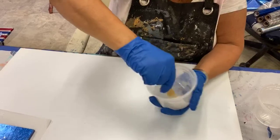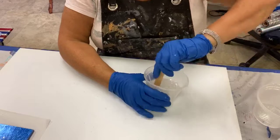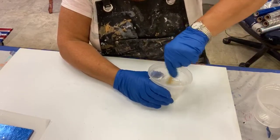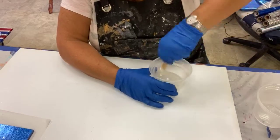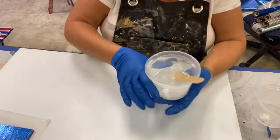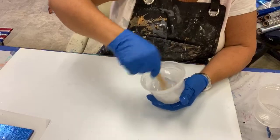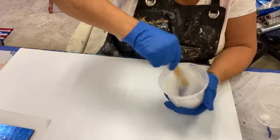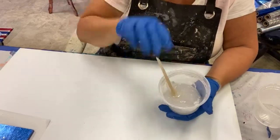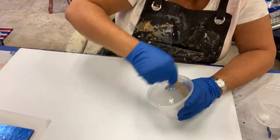And I'm going in here and I'm scraping the bottom, especially because it's not an even flat bottom. I gotta make sure I get in all the crevices in here and stir across, because I am not going to have this fail on me because I didn't mix it well enough. And it boils down to, you can either set yourself a timer and stir for 2 minutes, and that's a lot of work, or you can mix and mix until you're convinced that it's mixed enough, and then go mix double that amount of time. It's about the same thing. That's about how you come to 2 minutes.